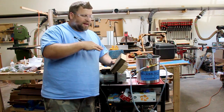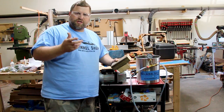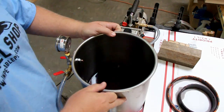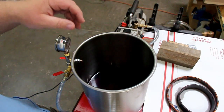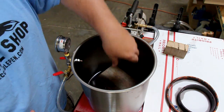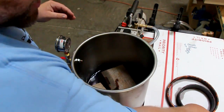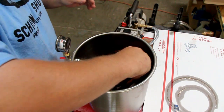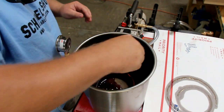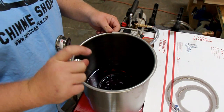I'm going to go ahead and put the wood in the pot and get it started. You'll see all the air come out — it almost looks like boiling water because there's so much air in the wood. I'm a little light on resin, this is all I had left today, but I'm going to make a go of it. Since I have the resin already in here, I'm just going to float these in. I use these old metal rings — they're really heavy — and I'll position them to sink the wood. You can see it's all under the resin now, with about an inch on top.